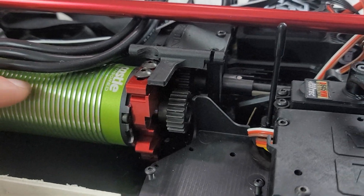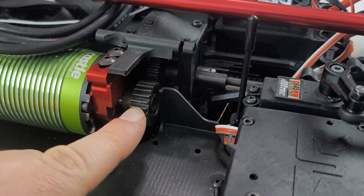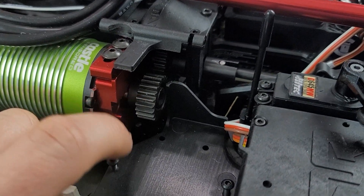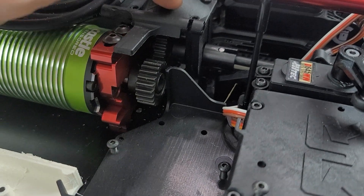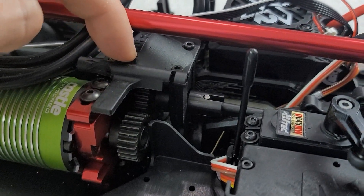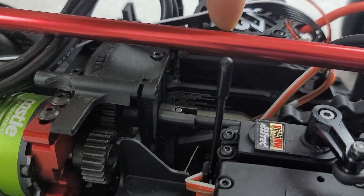We would probably end up with in excess of 140 to 150 miles per hour, and that is exactly what we are not trying to do. We want to target this for 100 miles per hour by carefully selecting the gears, and that's why we have the ratio we're looking at — we had to increase the size of that spur gear, which then led us into interference issues with the original position I wanted for the speed control.